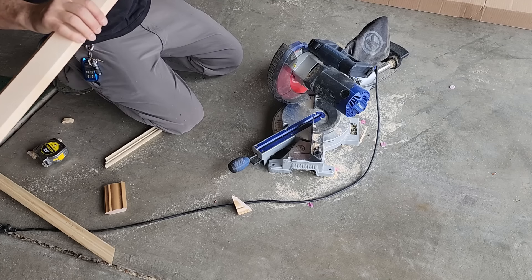Inside corners — I cut a 22-and-a-half outside corner by mistake. Got inside corners cut this time and I'm on my last shave job. That's how I'm doing a lot of these — just tiny little cuts. And when I start sliding these ones in, I can tweak it a little bit. You can't just let her rip; it's got to be very precise. I'll get this 22-and-a-half inside cut. That looks way more normal.